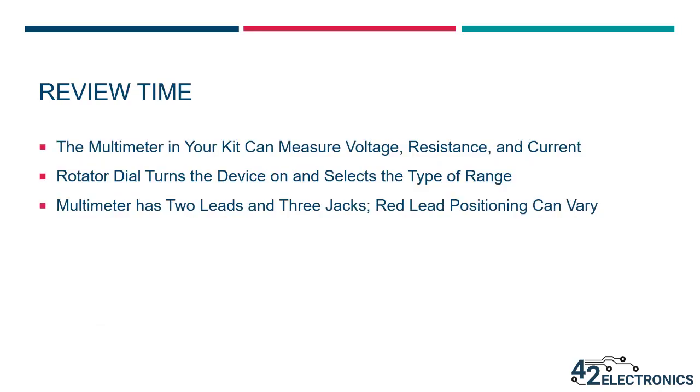Okay, before you move on to the next video for this lesson, let's take a few minutes and go over the few things we just discussed. The multimeter in your Level D kit can be used to measure voltage, resistance, and current, as well as check diodes and transistors. The rotary dial on the front turns the device on and is used to select the type of range that you'll be measuring. The multimeter has 2 leads and 3 jacks. The red lead can be plugged into different jacks based on what is being measured.